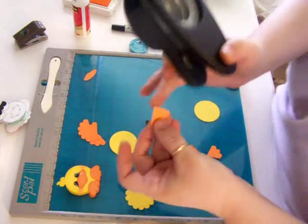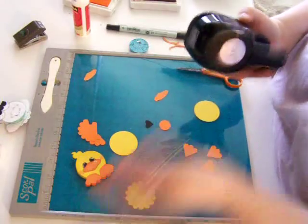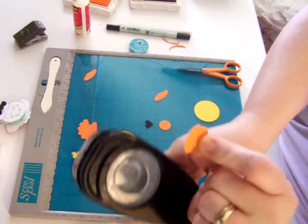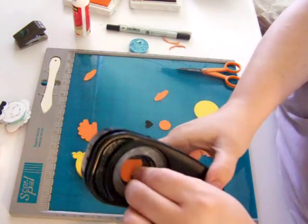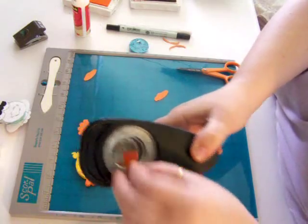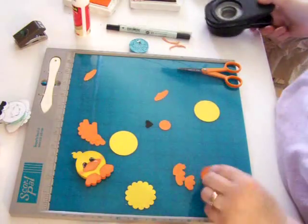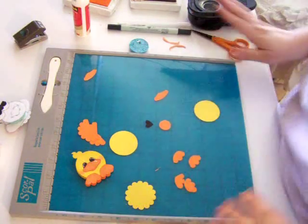Next you want the feet to be rounded — see how I have them rounded right there? All I did was take a one-and-three-eighths circle punch, or any punch that you can fit up in there, and put it in the tip of the foot and then punch. You end up with a little round piece. They do not have to be exact — I just wanted to round them. That's all I did. And that's how I did all of them. I got a little piece hanging here, so I'll trim that off.